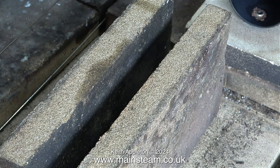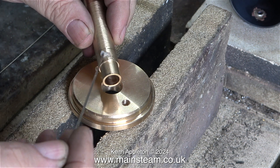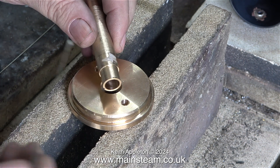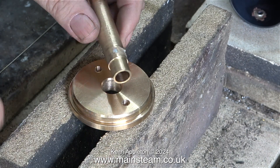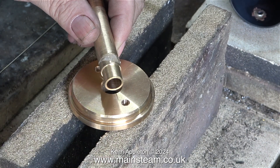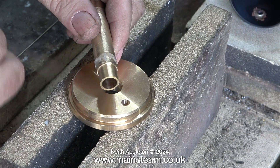I've moved it out of the way, and here I've stacked a couple of vermiculite blocks, also known as fire bricks, to act as a support for the top cap. This clip just shows the principle, but in reality it will be different. I've never made a boiler before, and I normally apply the flux to the parts to be silver soldered like this, but really it would be a better idea to use a paintbrush — it would be quicker and you'd get a more even coating.